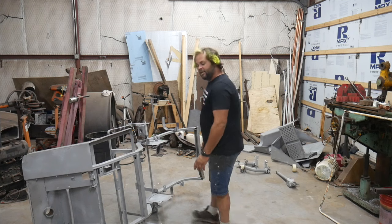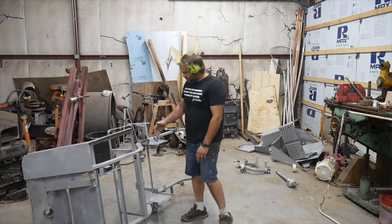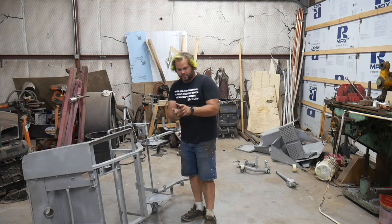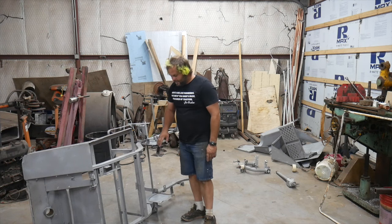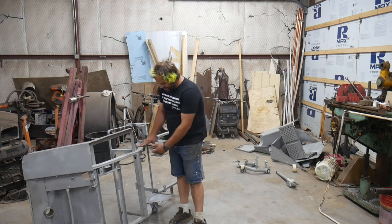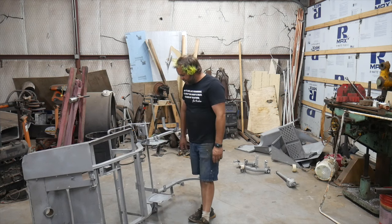This thing looks really good in comparison to what I had originally thought. All the corrosion, I don't know why, but there's sort of a line here. All the corrosion is just about this much of the bottom. There's no holes in the frame. There's no really deep pitting. I think I'm going to lay a piece of strap in the frame here, kind of gusset it just a little bit. Weld all this out real good. I think we'll be good to go.